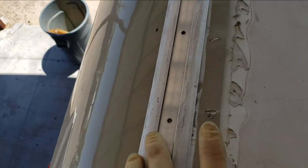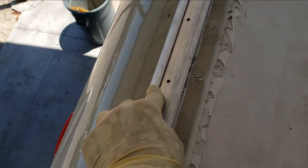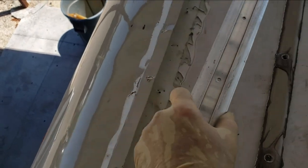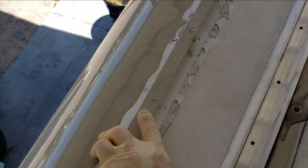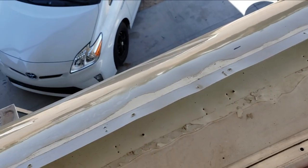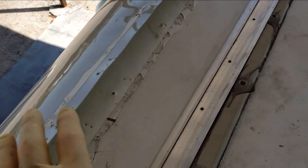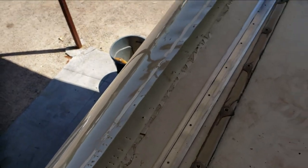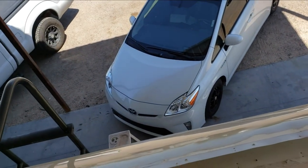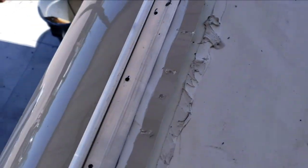It won't be quite as nice because it won't be painted, but I can fill this gap with sealant underneath and on top, and it will look a bit better. Because the molding is so wide, it'll help keep that spring from trying to pop back up. I'll screw this edge down with some truss screws, put sealant underneath so it seals and acts as an adhesive. I need to first cut this trim to fit and mark where the screw holes are going to be so I don't hit a screw I already put down.